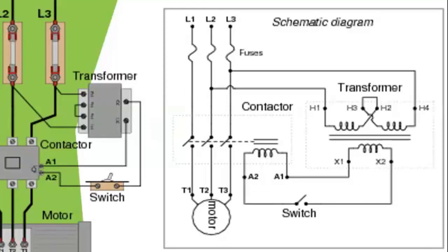When you look to your right, you will see that the schematic shows all the components in the circuitry: the fuse, the contactor, the electric motor. On the control side, we have the transformer, the switch, and of course this is the coil of the contactor.